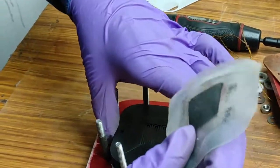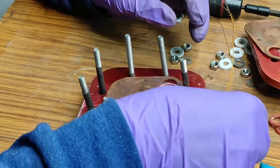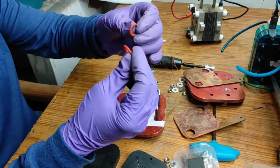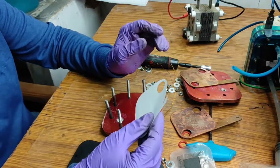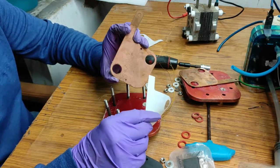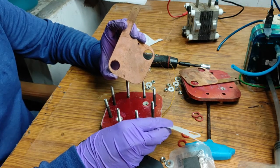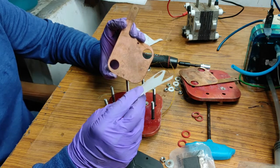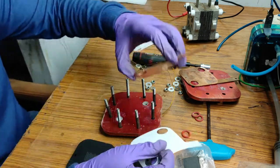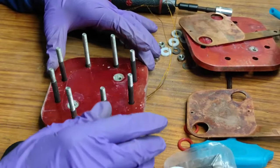This is a MEA — a membrane electrode assembly. Likewise I have taken the cathode or anode flow channel. This is the other side current collector made of copper. This is a silicone rubber o-ring. This is a Teflon cloth, which is required to avoid any short between the current collector and the end plate. The end plate is already anodized, but for extra protection I have this Teflon cloth to avoid the short between the current collector and the end plate. This is the final assembly with an aluminum end plate.